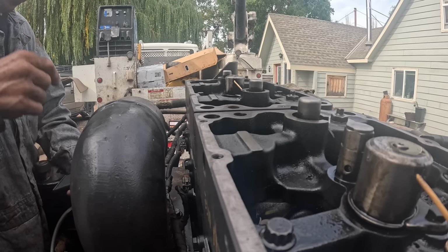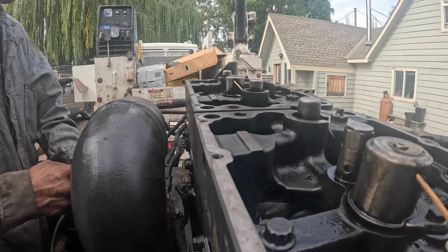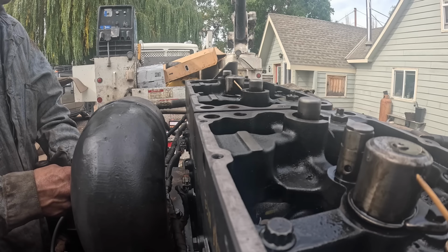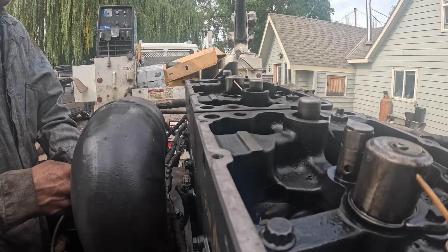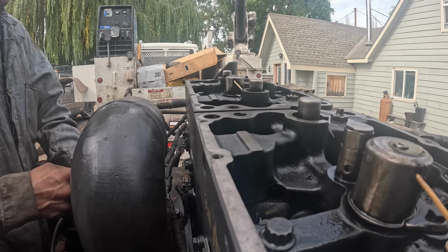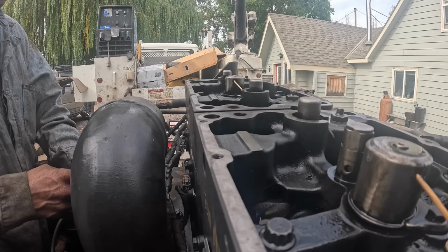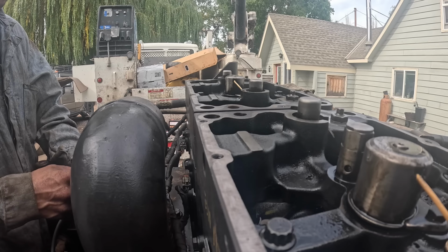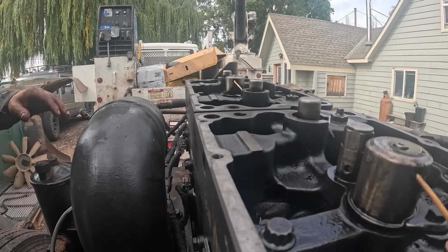Let's see here. I had this on my phone earlier. Let's look this up here. Okay. I tighten the rocker lever housing cap screws, 85 foot-pounds torque value. So the engine brake housing washer cap screws, they're 75 foot-pounds. Let me torque this one.